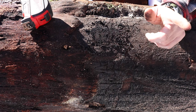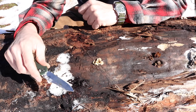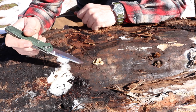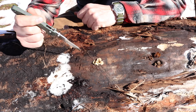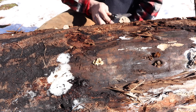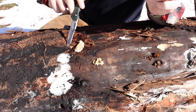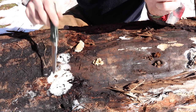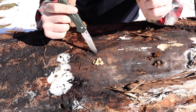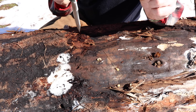They're reaching the end of their shelf life. Let me show you why. When you get trees down on the ground, if you're going to be using them for timbers, it's nice to use them as soon as you can — probably within a year or so. These have been sitting down here, and it was pretty wet this winter, and we're starting to see the mushrooms and the fungus. You can see some of the larger fungus there. That's going to start breaking down the wood and it'll actually start getting punky and soft. Leaving the bark on them will really expedite rot and decay. So if you are going to have something down for a while and you plan on using it a year in advance or so, strip the bark off of it, get them up off the ground, and they will hold better.